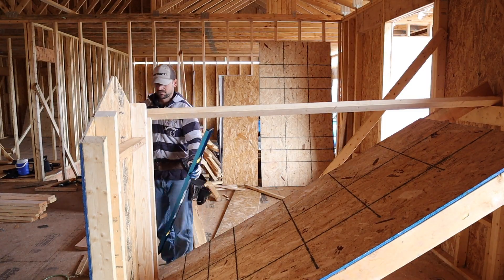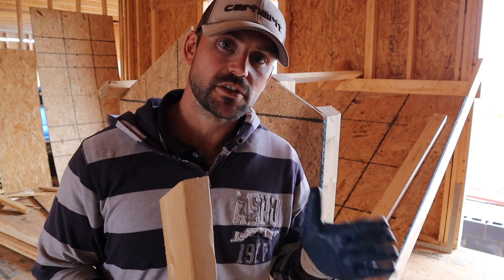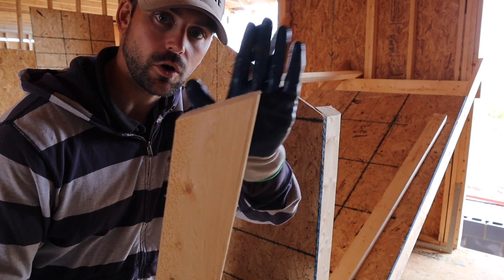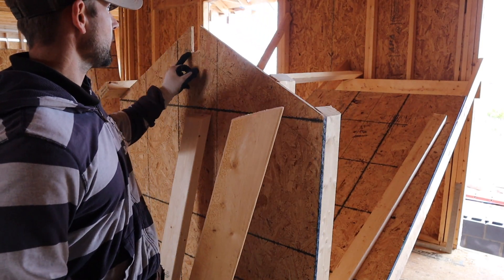Before I build the sidewalls, I've got to build a roof rafter template so I know exactly the height of that sidewall — these are going to be two-by-four rafters, 16 on center for the roof. I put a 7/12 on this rafter, the beginning rafter, and go ahead and line it up flush with the edge of that slot we cut out yesterday.